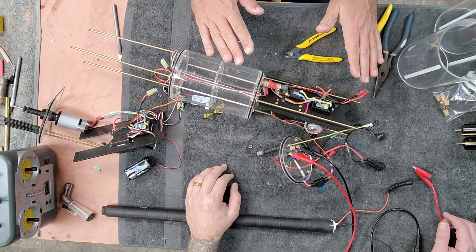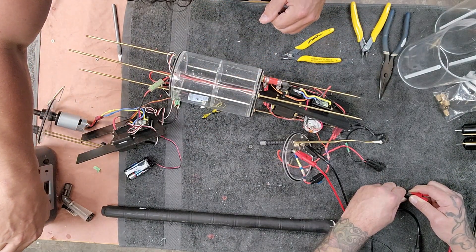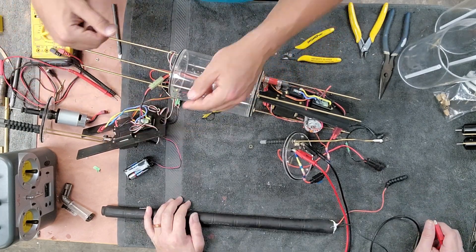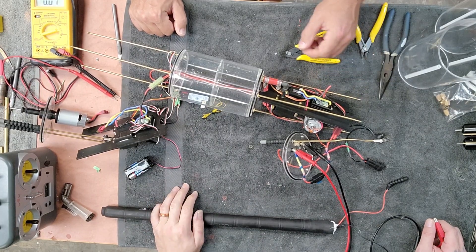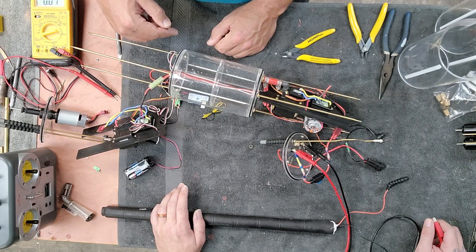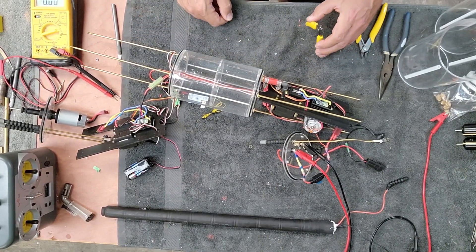So now it's no longer part of the equation. Let's try and plug it in and see if we blow a fuse. It's not spinning the motor. Nothing. Both of these speed controllers are shot. This one was blowing the fuse, and this one is not putting out any voltage when it gets power. So it looks like we're replacing both electronic speed controllers.